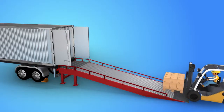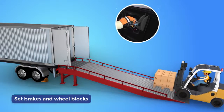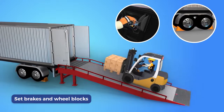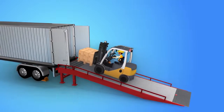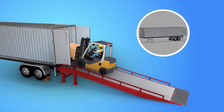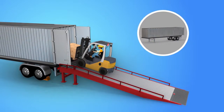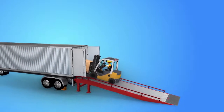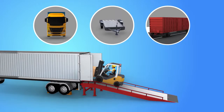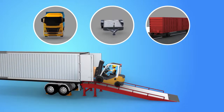When you're loading or unloading the forklift, set the brakes and put wheel blocks in place to prevent movement of trucks, trailers or railway stock. It may also be necessary to support a lorry trailer that's not coupled to the cab with fixed jacks. Check the floors of trucks, trailers and rail wagon cars for breaks and weaknesses before driving onto them.